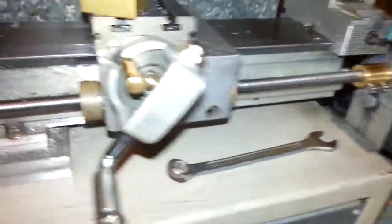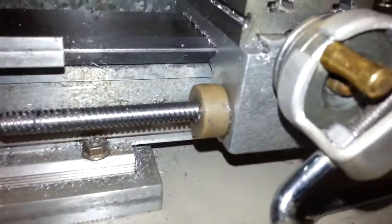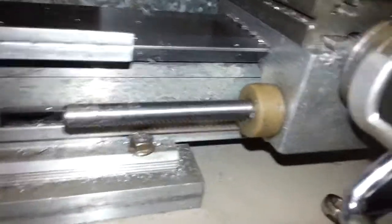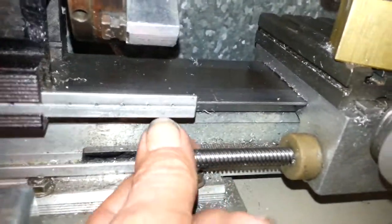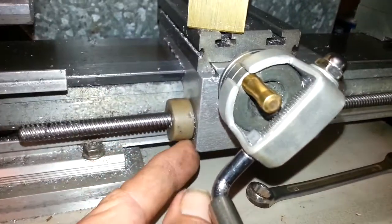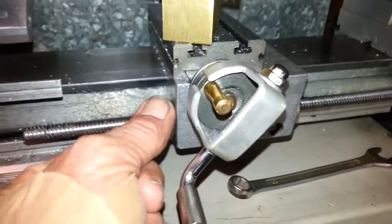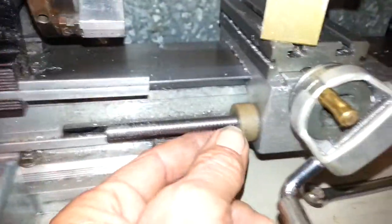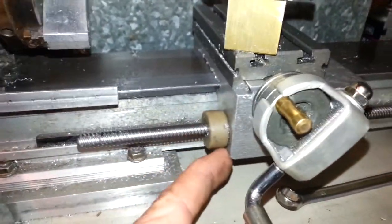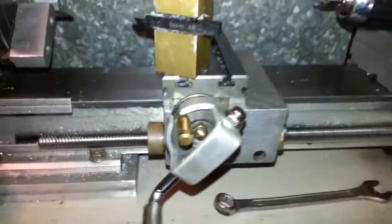And then somehow I jagged myself a little anti-backlash nut. Got PlastiBond, two-part PlastiBond, made up a little nut. I made that out here. I was able to take it off, cleaned it up, machined it up, wound it on. When I pulled it on tight, it took away all the slack. So I put a bit of glue on it, good old Araldite, and the thing stuck there well. Backlash is gone.